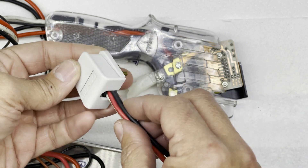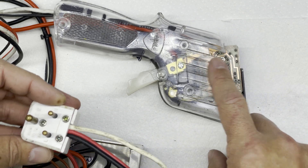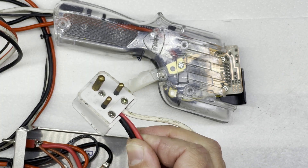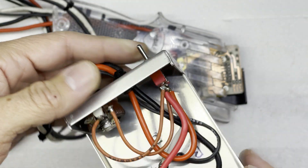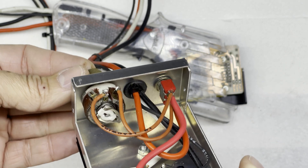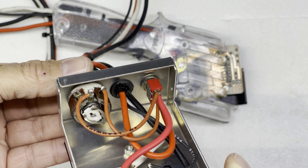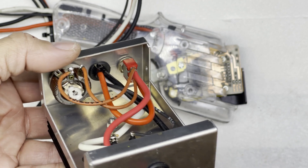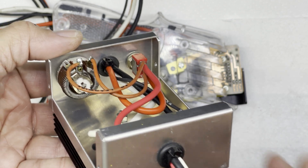That's a very simple explanation. All you really need to know is that when your controller brakes and you go back onto the brake band, you're shorting out these two wires. A direct short gives the most braking possible. So what this controller has is adjustable brakes - it's got a switch to engage this potentiometer, which acts as a big resistor. By putting more resistance in, your motor has less braking because it takes longer for the energy to dissipate since it's not a dead short.